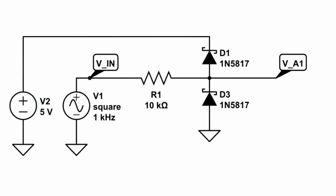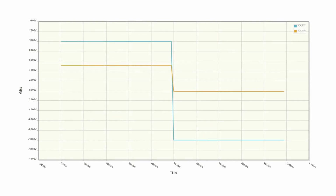You don't know what those pins are going to be connected to. The input voltages might be too small, in which case it might not work. They might be too large, in which case they might damage the Arduino. And maybe the outputs produced by the Arduino aren't suitable for sending to the other modules in your system. So on all of your inputs and outputs, you're going to need a few components to condition the signal and make sure it's in the right range of voltage and current.